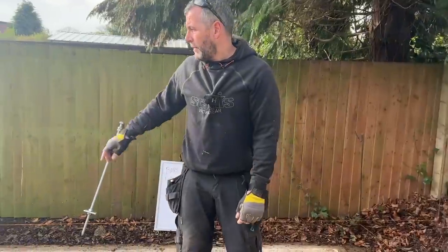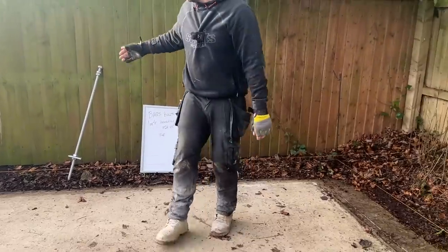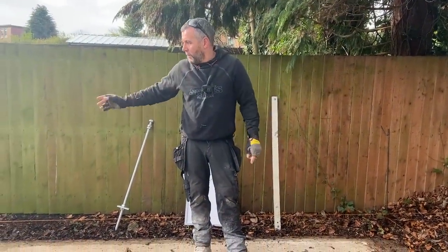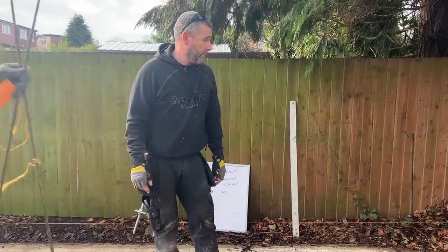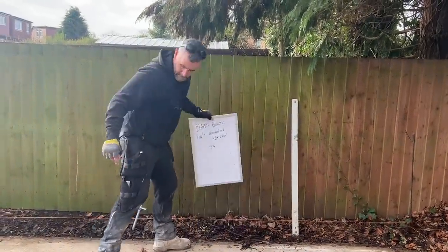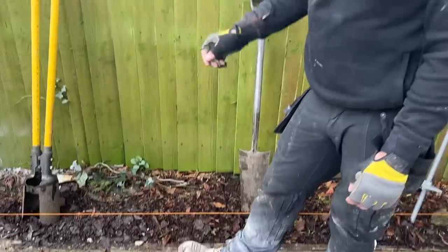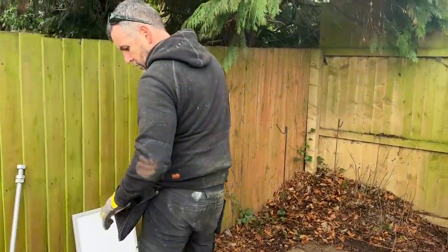So what they'll do now — he's got his back, his two sides, and he's going to do his front now as well. It's looking pretty square, so we'll be happy with that, and as soon as he's got those lines on, we will then dig holes. We're going to dig the back line first — because it's five metres, we will have six holes on the back wall.